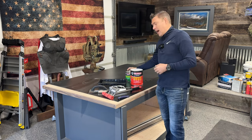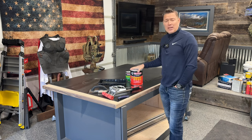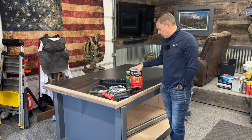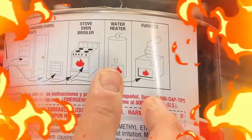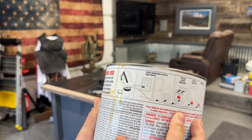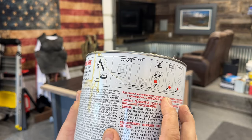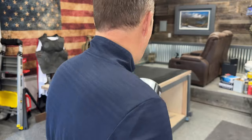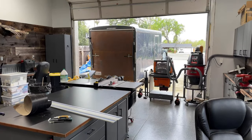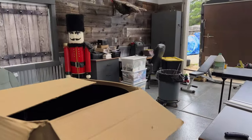Keep in mind these things are highly flammable. They recommend you don't do it near a pilot light — a water heater, a stove, or anything that could ignite. The vapors can travel along the floor to any source of heat, spark, or flame in the next room or in the basement. All the warnings on the can are telling you to turn off all gas valves if necessary. Really take that seriously — wear a respirator and work in a well-ventilated area.